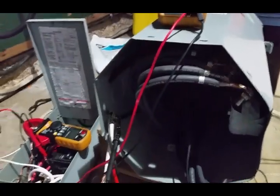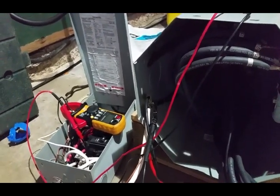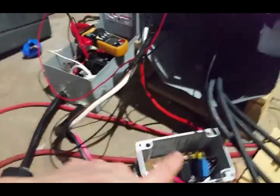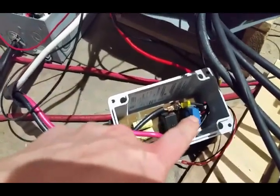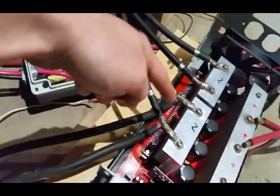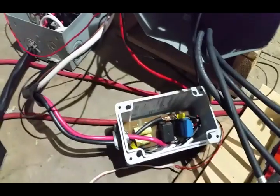I have this set up at split phase. Normally it would output 240 volts and it does output 240 volts, but the center tap of the transformer I've connected to each other and to ground — both earth ground and neutral. And then I have some filter capacitors down there with the feedback transformer for the inverter. The DC goes in there and down there, AC comes out there — big thick wires for this 7500 volt-amp transformer. There are four output wires; two of them are joined together on the ground lug, and then I go from the feedback transformer into the breaker box.